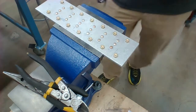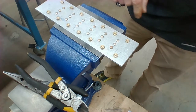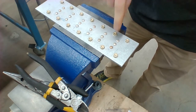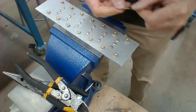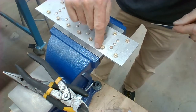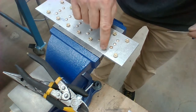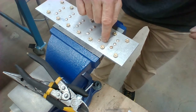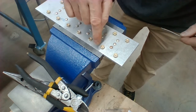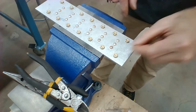So to start off with, I'm going to want to wire this bolt to this bolt right here. Remember, I want to start in an S pattern. I want to start up here at the top, not at the bottom — come around, then come around this bolt and finish out down in this area. So starting over here, ending over here, making an S pattern.